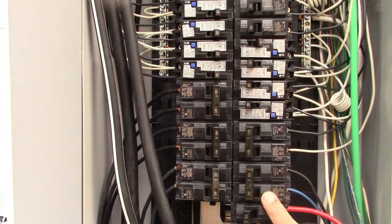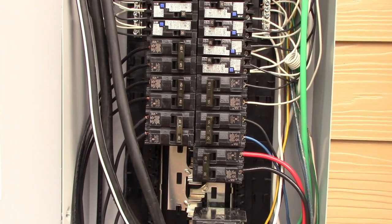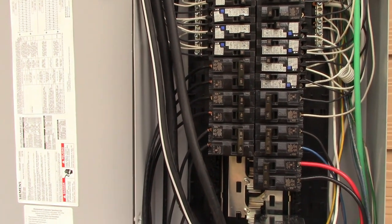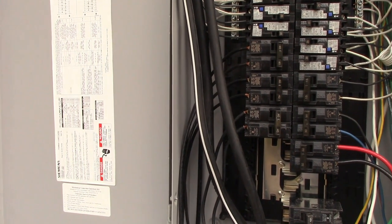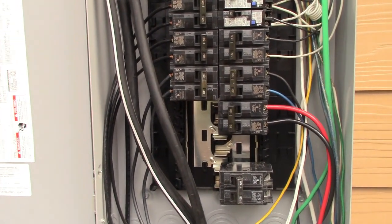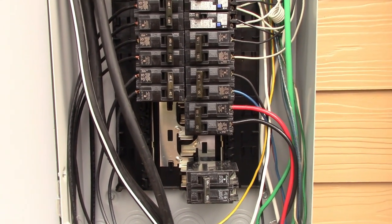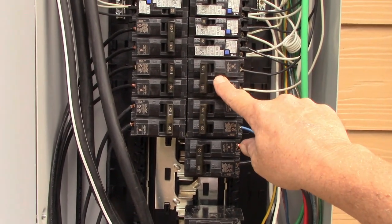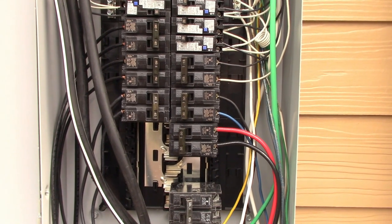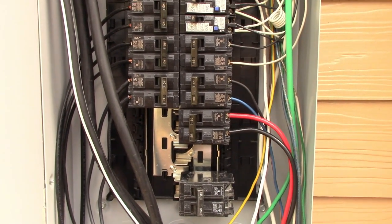Keep in mind, a portable generator will not power an entire 200-amp panel. When using whole-house standby generators, for permitting, one of two things has to happen: either the generator outputs enough electricity to accommodate the full load of the house, or you use load shedding devices that balance loads — as one thing kicks on, it kicks something else off so nothing gets overloaded. For load calculations, even with a 200-amp panel, the actual calculated load might only come out to about 125 amps, so your generator either has to put out 125 amps or you use load shedding.